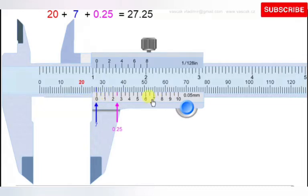Now look at the Vernier scale markings to find where one of them aligns with the main scale. You can see that this line here is directly on top of this one. Reading that off gives 2.5. You then multiply 2.5 by 0.1, which is the accuracy of the instrument, giving 0.25. Adding 27 plus 0.25 gives a final reading of 27.25 mm.